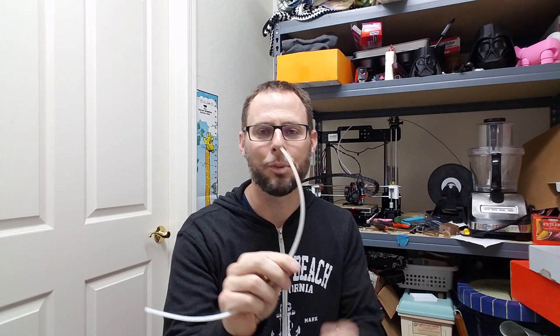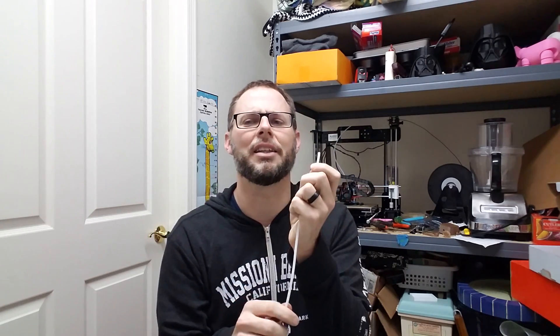So I used just this little bit of tube, took some sandpaper, and sanded like crazy till I got it in there, and it works — now I'm up and printing. I ordered the heat breaks, they will be in in a few days, and I'll switch back over to those because they'll be a more permanent solution. But I'm back up and running.